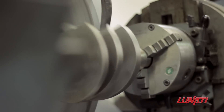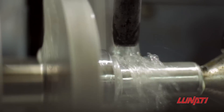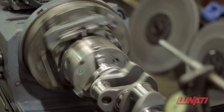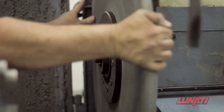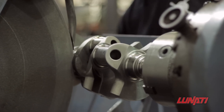At this point, the crankshaft snout surfaces and seal surface are ground. After the snout and seal surfaces are machined, the crankshaft grinder wheel is changed to a special wheel that is the exact finished width of each particular main journal.